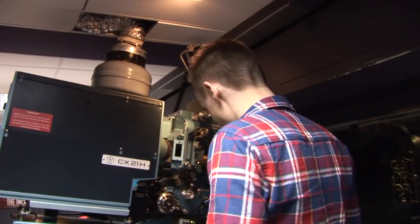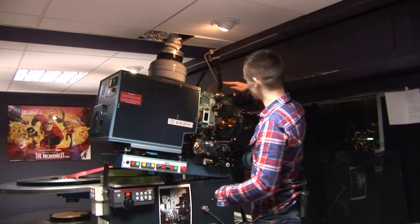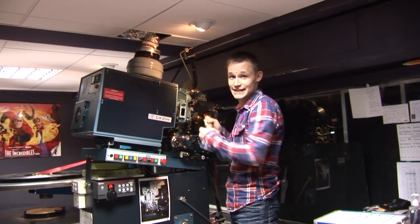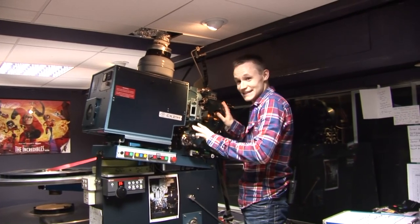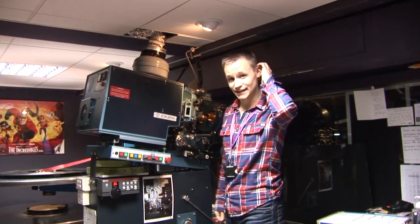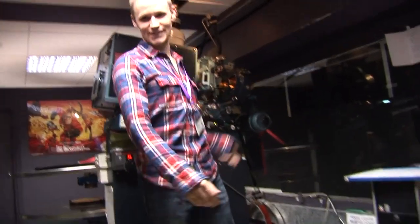It's incredible. Fantastic. And then it's your job to literally take it all out of the projector, take the knackered film out, cut new, fresh ends, join it, but however much, it doesn't matter. You've got to take out seconds sometimes, whole seconds of film that are completely knackered, and then join it back together and get it back on the screen. To applause, I hope. Think anyone really noticed that second thing missing. No, you get a bit of a Laurel and Hardy thing going on where there's something like, oh, and then they're there. Yeah, 20 in a row, just clattering through the projector.